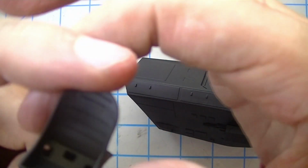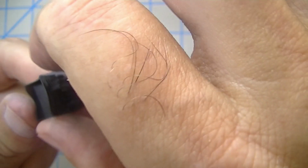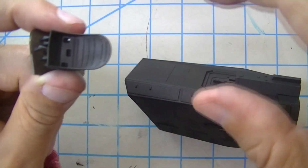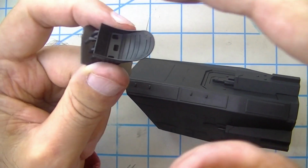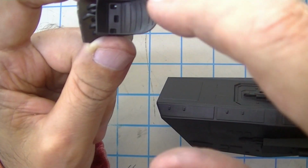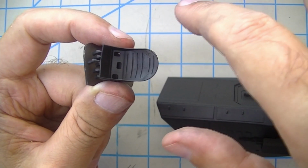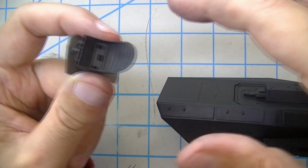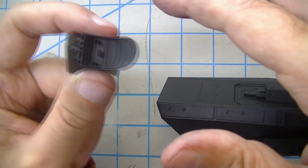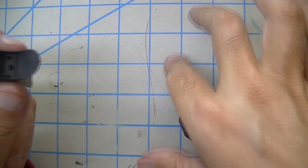I've got it set on standard level 8 in Lychee, and I haven't even really started experimenting with that yet. For any of you who don't know what anti-aliasing does, imagine that when you mask off a cross-section using an LCD, you're basically generating pixels, just like on any sort of video screen or LCD, LED type screen. And so you're approximating curves with little squares, just like on this cutting mat.